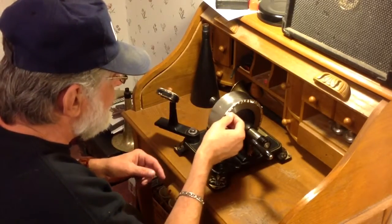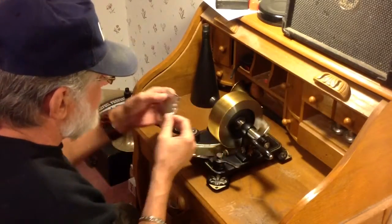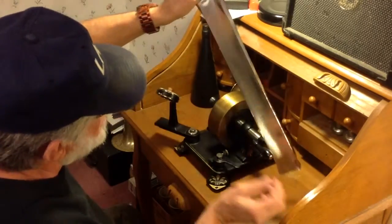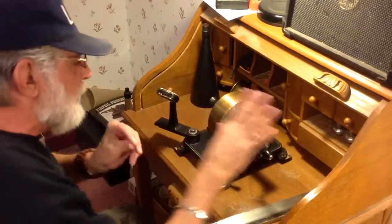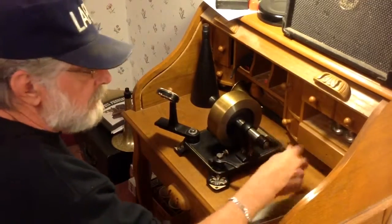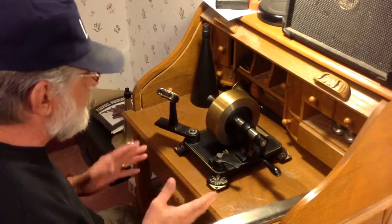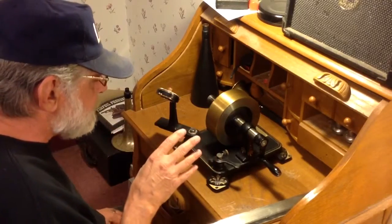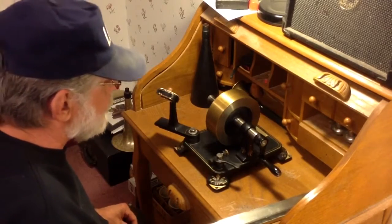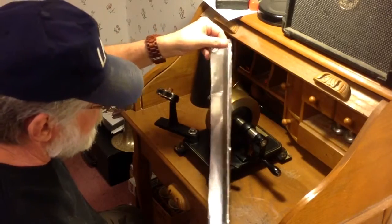That's interesting. This is something new — I've never recorded on tin foil before, and this is only my second recording. You can see it has good modulation in the grooves, it's just so noisy, and the recording itself is really weak and way in the background. Whereas I've used some aluminum foil and copper foil that would make a voice recording almost as good as a cylinder. I've made some really decent recordings on this machine and I've just been continuing the experiments to find what works best at the lowest cost, and doesn't require 20 minutes setting up. Copper worked really well and some aluminum foils have worked really well, but tin foil just does not work very well at all, at least on this machine.